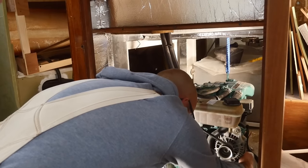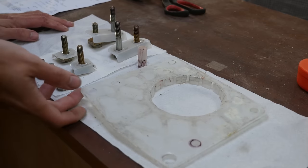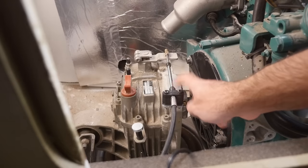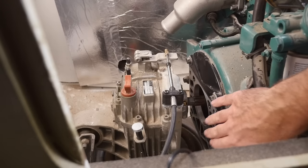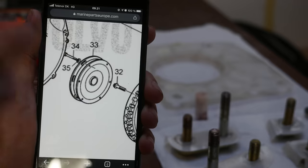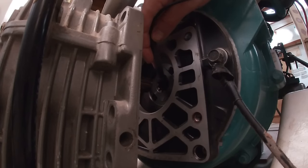After a little bit of head scratching, I got the engine and the sail drive pulled apart so I could remove the plastic insulators as well as the little plastic bushing. I got a bunch of comments asking how the sail drive can be electrically insulated from the engine when there's a shaft via spline connecting the two. It turns out inside the flywheel housing there's a flexible coupling — number 33 on the exploded diagram — that insulates the shaft of the sail drive from the engine. There is no connection between the spline and the engine, which makes me believe the flexible coupling is not the culprit — nice, because it's a $500 part I would hate to replace.